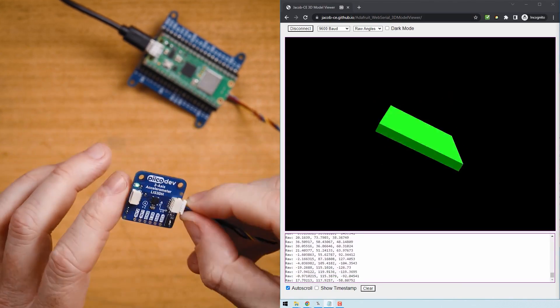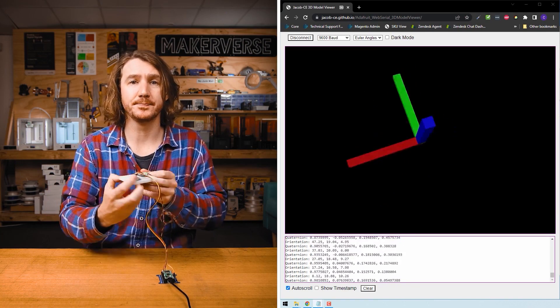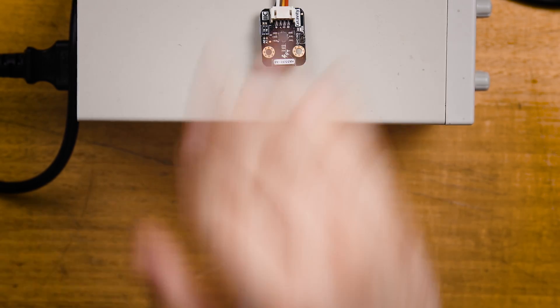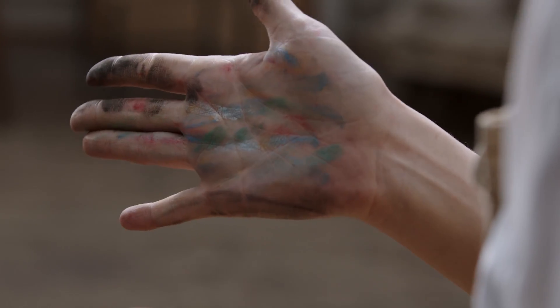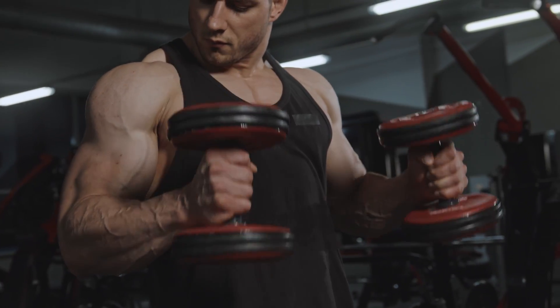In all of these methods we've moved our body somewhere to interact with hardware, but what if we measured the movement of our body directly? You could strap an IMU sensor to yourself and track movement, rotation, and angle to get gesture control into your project. You can also get gesture control modules which let you swipe and move your hand in mid-air — a great option for no-touch interaction like if you had wet or paint-covered hands. Going further, EMG sensors attach to your body and measure your muscle flexing, turning that into a signal.